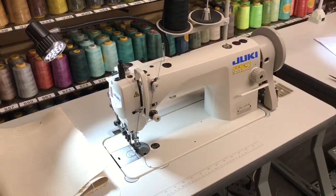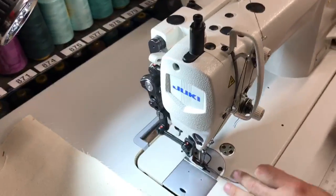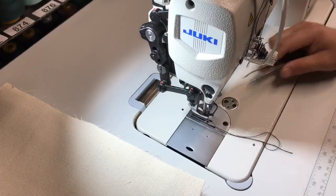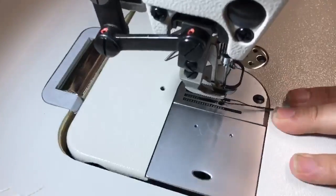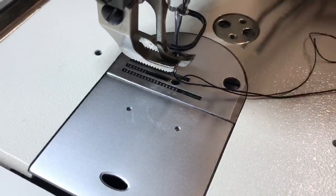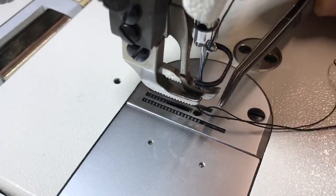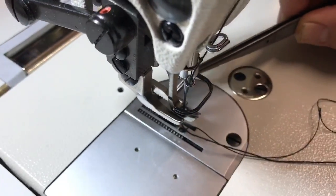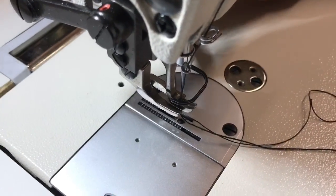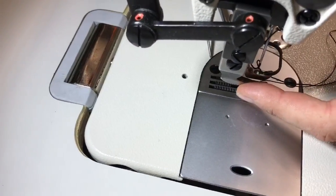Before we go on, I'm going to show you why it's called a walking foot machine, or top and bottom. This is the bottom right here — we call it a plate and a feed dog. On top, this is not a normal foot — this is a walking foot. There are two feet: we call them the inside foot and the outside foot. The inside foot is stationary and doesn't move; the outside foot is the one that really works, feeding the fabric and moving it through.